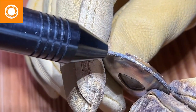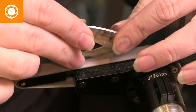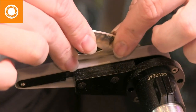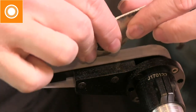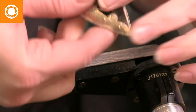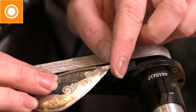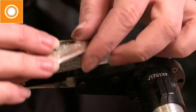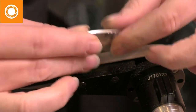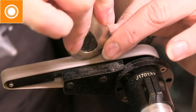I'm continuing along around the piece. Now is our real test — I'm going to use this little belt sander that hooks up to my number 30 handpiece on my Fordham flex shaft. This is about 150 grit and I'm sanding away those weld surfaces. This is where you'll really have your test, because if your weld was not deep enough you're going to find it right here. If you have any pits or dings, you're going to find them right here.